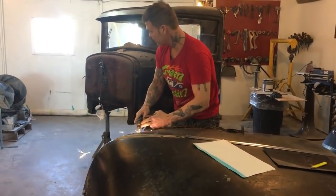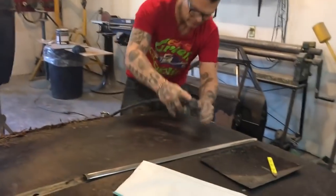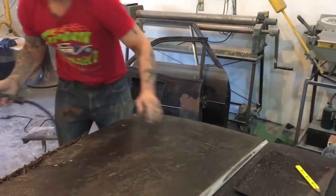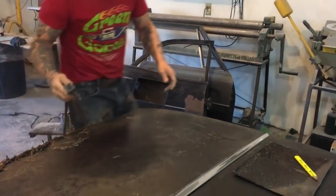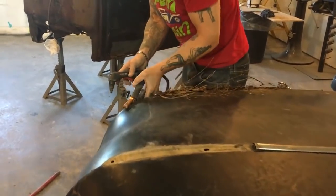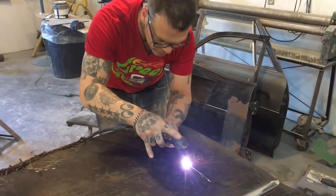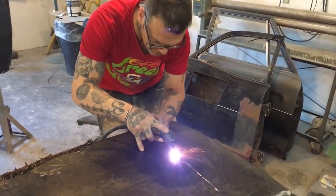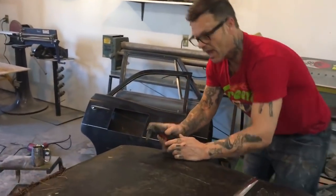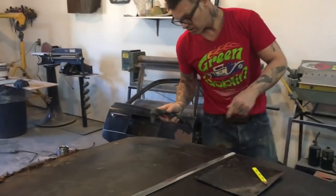All I'm doing here is making a ground — just scratching off the paint a little bit, that will give me a ground. I've got fuse problems already, haven't got a good ground. The reason I'm using this plasma cutter is because you get the job done faster. I can take a mini grinder and cut that, but it costs you five to ten bucks every time you use one. I'll cut all the pieces out of that hood with this — gotta be fast.